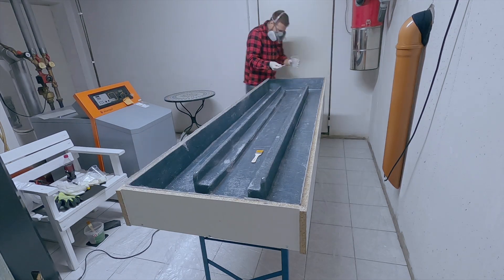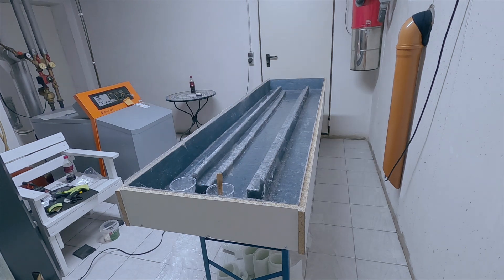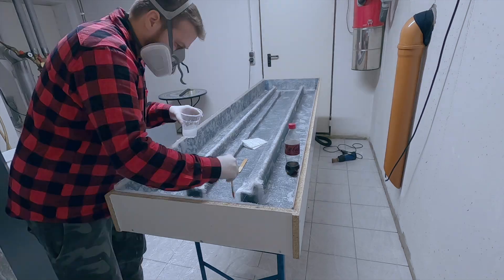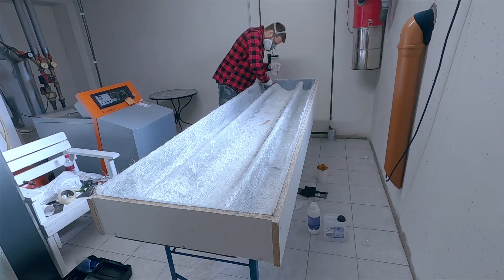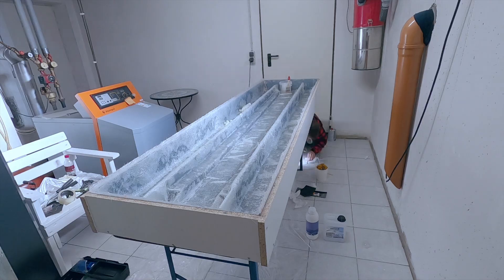After the coupling coat hardened I followed up with a second coat of pre-cut 300 gram glass fiber. The 300 gram powder bound glass fiber was much harder to work with as the powder did not dissolve as nicely as the emulsion. It doesn't matter though — a couple of air pockets won't make a difference at this point as these heavier glass fiber mats are just meant to reinforce the entire structure. For my third and final coat I went for a full uncut sheet of 300 grams again to add even more rigidity to the mold. It wasn't quite easy to lay down and wet out in one go so I cut it in half, laid it up nicely, and let it cure completely.